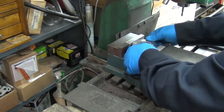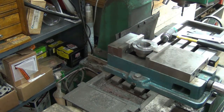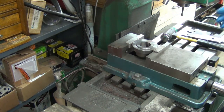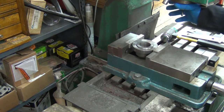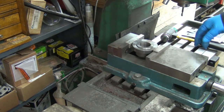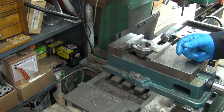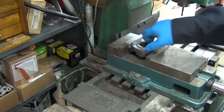That's definitely solid enough - I could drill out here without twisting or pushing it. I've got the collet and the drill bit in there. The other reason I'm going this route is because I'm lazy - I would have to raise the mill head up to put the drill chuck in, and I'd also have to change out the spindle hold-down bolt because the drill chuck arbor is a different thread pitch. It would be better to do the edge finding with an edge finder, but the outside here should be concentric enough that touching the drill bit against it will put me within a thou or two.